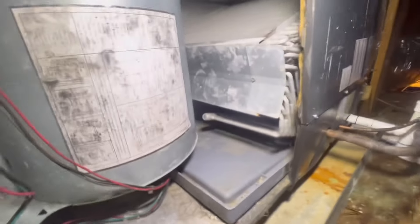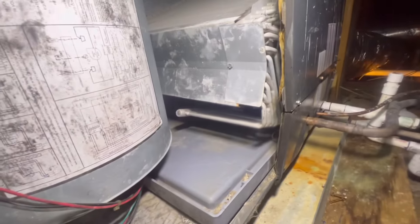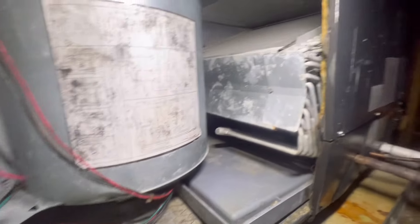In here, I'm going to make sure all this is cleaned up. Because over time, even when it starts sweating, algae and all that can get worse and can end up stopping the drain. I also like to check the blower wheel — probably just clean it up a little bit and make sure everything is good.